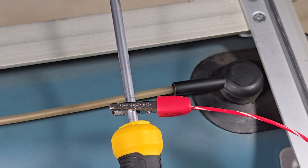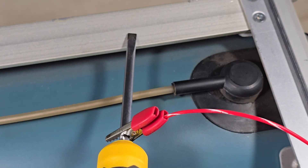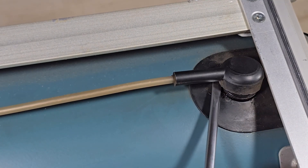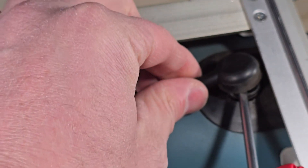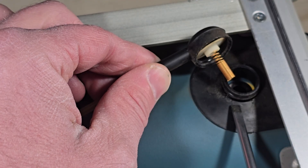This is a crude setup. I have a screwdriver with a wire attached to the end, and the other end of the wire is attached to the chassis. We are going to lift this button and touch the spring inside with the screwdriver to make sure that it's been discharged. That's an important safety consideration because the CRT can hold a charge long after the oscilloscope is powered down.